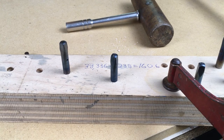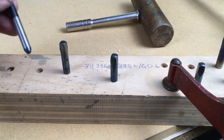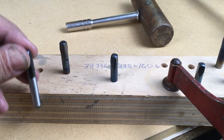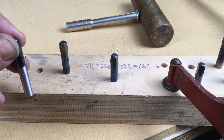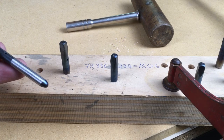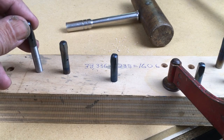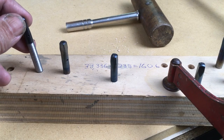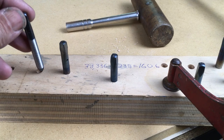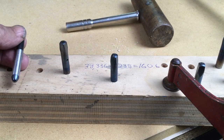The other distinction between straight shank pins and tapered pins is that if you have one of these driven into the hole, you have to turn it up, turn it up, turn it up, and you can see the threading on this. It takes quite a few spins to get it out, and all of that is under intense pressure, and you build up heat if you don't take serious time. And you can glaze the inside of the hole, and you basically wear out the hole.